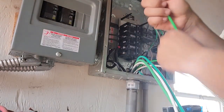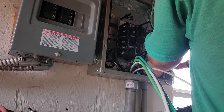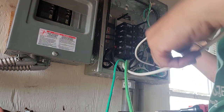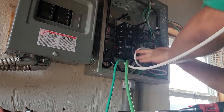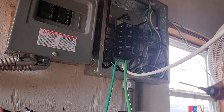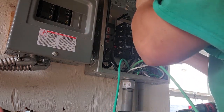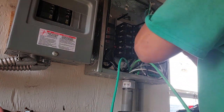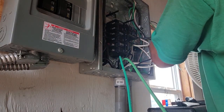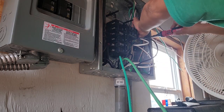Yeah, then you had to work with what you had. Obviously, you should not use green wires as hot wires. That's why I marked them with red tape. Again, not perfect, but those are hundreds of dollars worth of wire, and I'm not tossing it. The only one that should be messing in the electrical box is me. And Jess knows, probably would not mess with the electrical box. So I think we're good. Yeah, and as long as it's clearly marked what it is.